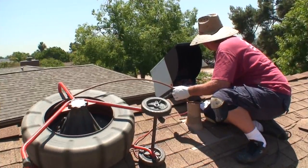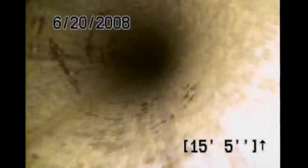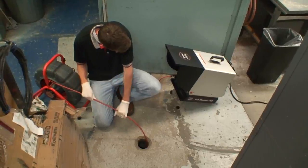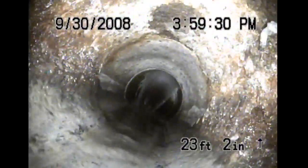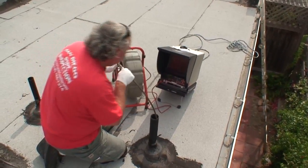If you're new to pipe inspections, you'll find that it's easy to lose your sense of direction inside a pipe. This is another case where running a bit of water in the line can really help. Water can help you determine the direction of flow so that you know which way your camera is headed. Water can also help you identify lines that tie into the line you're inspecting. And if you're using a non-self-leveling camera, water makes it easy to differentiate between the top and bottom of a pipe so that you can maintain your sense of direction through turns.